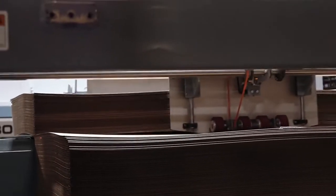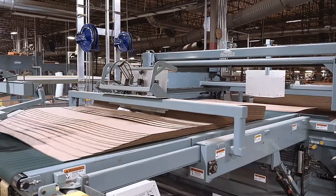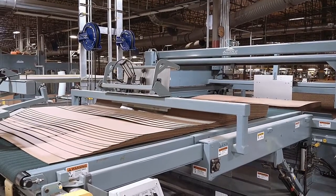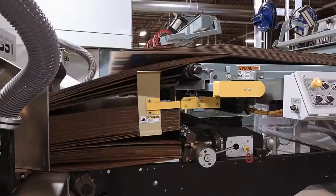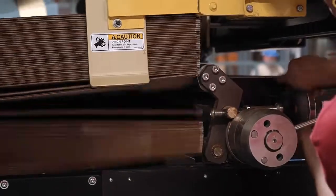Each stack is broken down into smaller sections called blocks, and shingled individually to a feed table. The sheets are fed via a set of feed wheels that work in conjunction with feed rolls that insert the sheet into the machine.